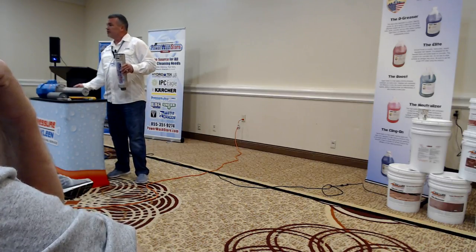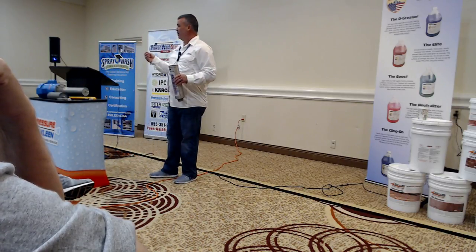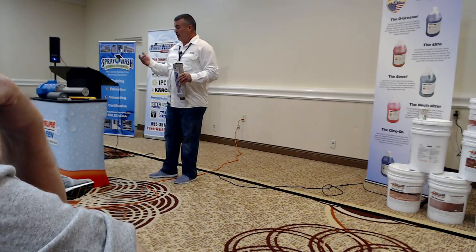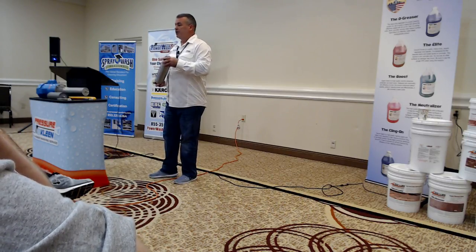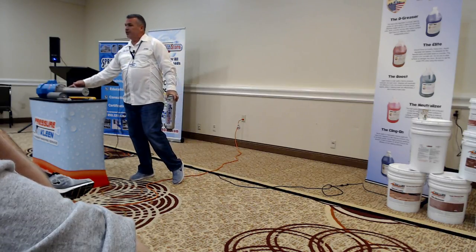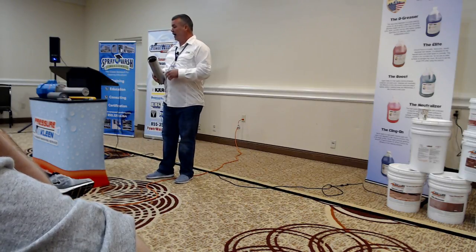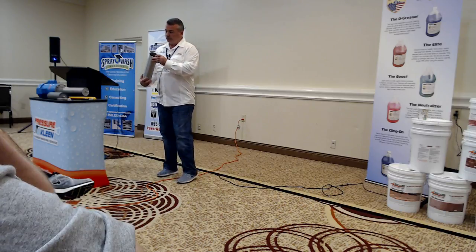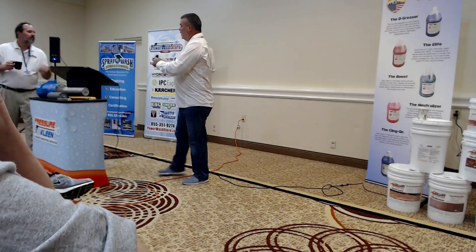Clean these threads. Take a toothbrush or whatever, clean these threads. I use Magic Lube. It's a non-petroleum lube, like a jelly almost, so it's good. Brenda, you agreed, in the spa business, petroleum sometimes affects your O-rings and stuff. So clean it up, lube it up, and put it back on by hand, tighten it up. You can tighten it back up with a strap wrench, but it's not going to make a difference. Once it's tight, it's tight. You're only going to get it to go a tiny bit more if you really torque it. But you've got 3/4 inch of fine thread, so it's locked down good.